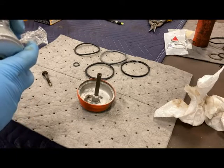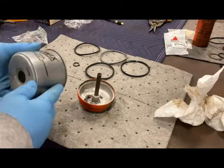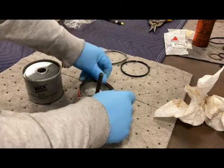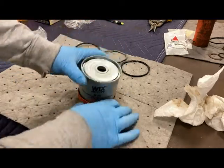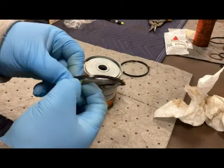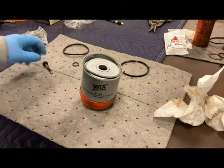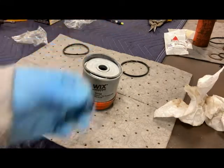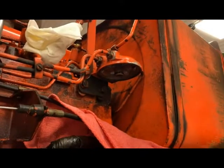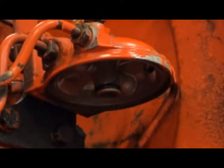We'll go ahead and open this filter. The filter is going to set like this — we're going to have one of these o-rings down here on the bottom. Then there's one with a yellow mark; that's the one that's going to go up on the top side, inside the bottom of that filter housing. So let's slide over to the tractor. Right there is the housing, and right here is the o-ring I'm talking about — you can see it's got a little fray in it right there.